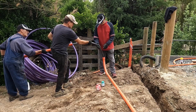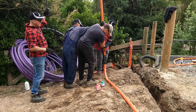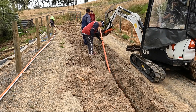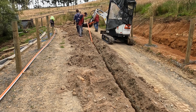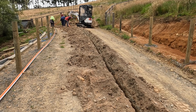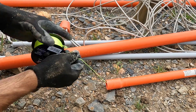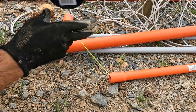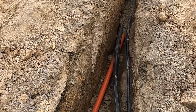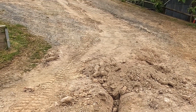I think you'll like the smell of baby powder! This is out at the meter box end - we're just feeding this in. You'll see a bit later all the cables that end up at this meter board. Laying the conduit, we used the excavator to make sure we didn't drop dirt in the hole, since it's quite narrow - and we literally laid nearly 150 meters in the hole in about 10 to 15 minutes, so that went like clockwork. For the 32mm conduit I had to run some smaller cables through - I just use a string and a vacuum cleaner and it sucks the string through no problem, up to 70 meters without issue. A bit later I've got the power in there, the water main, the data, and in the background you can see where I've backfilled and compacted it.